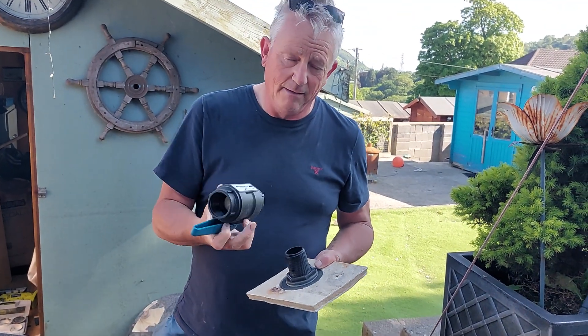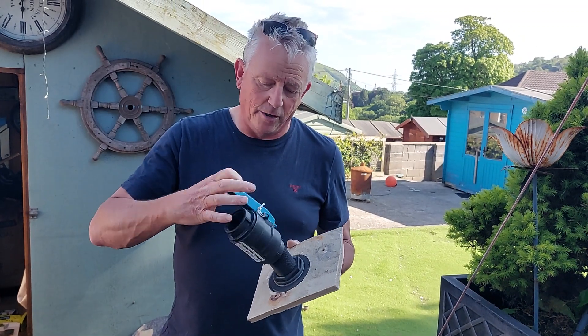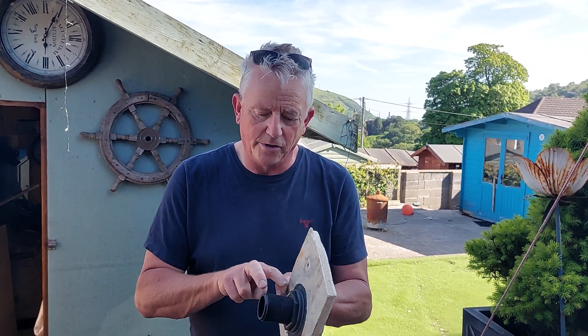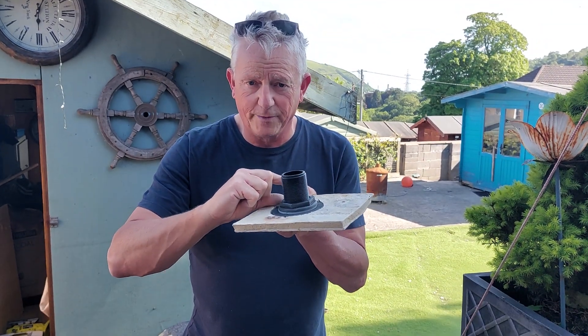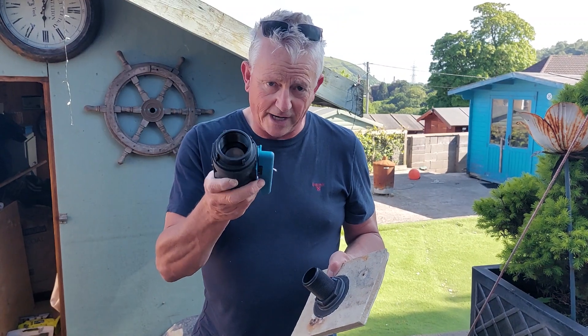In the UK, as long as it's not in a vulnerable area, you can put the valve straight on. From an engineering point of view, this is 38mm, so you should never have more than 38mm of thread sticking up — one to one and a half times absolute maximum — but obviously you need enough thread, so just check the depth before you cut it off.